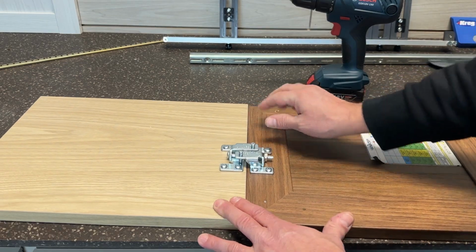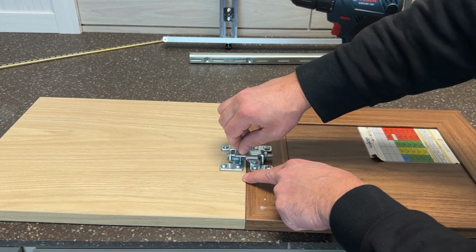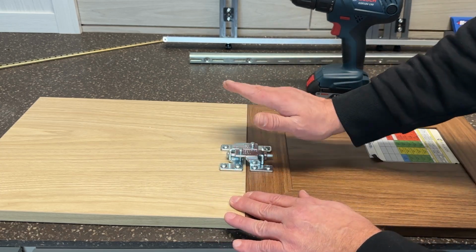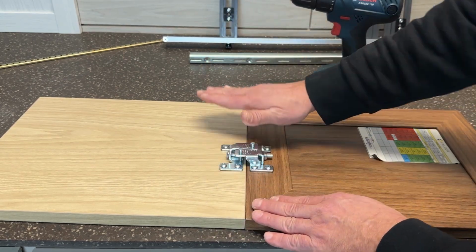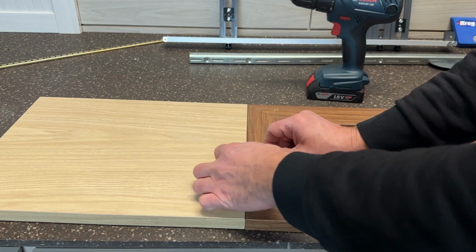So now the benefit is when you put these two pieces together, you can use these screws here to raise and level the two surfaces, especially for countertops. And so you could have this flipped over underneath as a countertop, adjust these, get it just right, and you have a few of these going down the road, and then just tighten this bolt down.